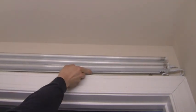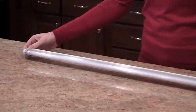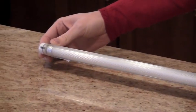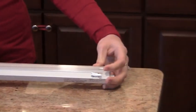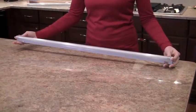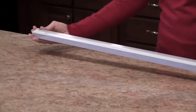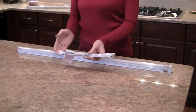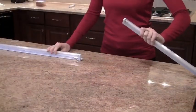This is our microfluorescent T4 fixture. The T stands for tubular and the number following it represents the diameter of the lamp in eighths of an inch. It's a two-wire or non-grounded light fixture. Commercial installations typically require a grounded or three-wire fixture, but that's not necessary for a residential application. It comes with a six-foot power cord to plug into an existing electrical outlet, or it can be hardwired using an optional hardwired junction box.